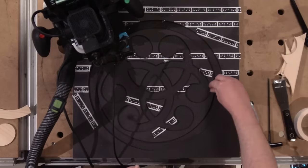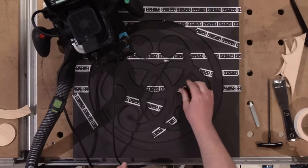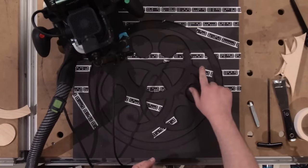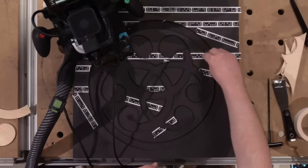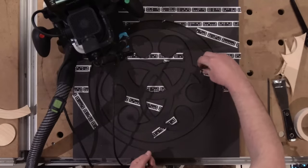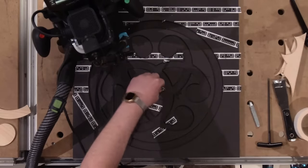Yeah, and as a reminder, when we're cutting through strips of tape, if a domino is damaged, that means Origin can no longer see it. So this one is almost complete, but it's cut off a little bit there. So it's a dead domino. It's not going to use it. You need a complete white boundary around the whole thing, and no cuts through the middle either.